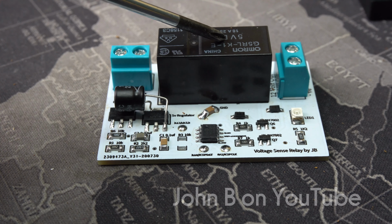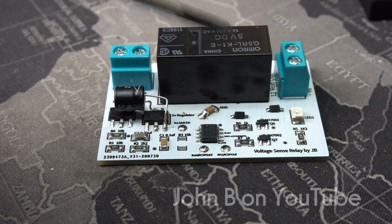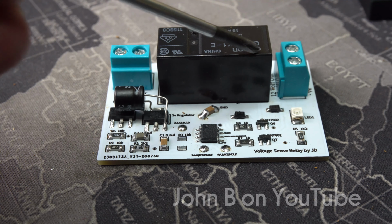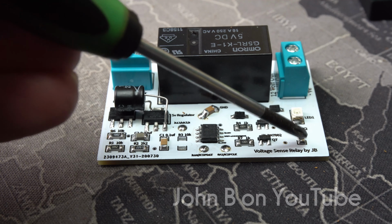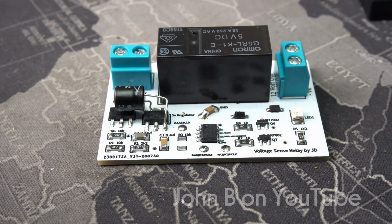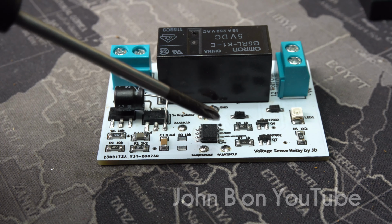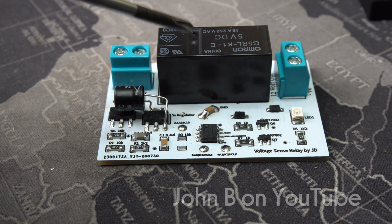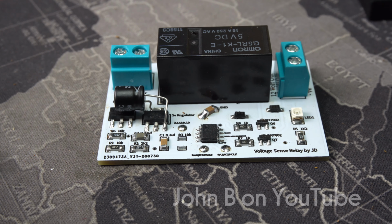Because it's a latching relay, there's two coils, one coil to turn it on and one coil to turn it off. So we've got two resistors, two FETs, pulling each coil down to ground to turn it on and off. And a small LED as diagnostics, just tell you if it's on or off. These round circles are so you can program it, just hook it up to the programmer and program it. I'll put the code in the show more, and I'll put the circuit drawing in the show more, because this circuit I used again on my later one with a USB charger.